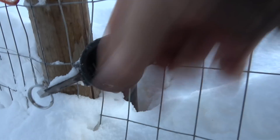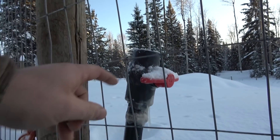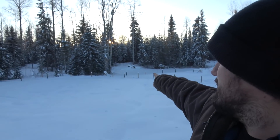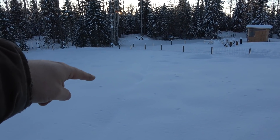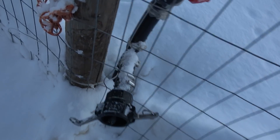And this is the really easy quick connect for the pump. I can prime this guy and it takes about 3 gallons of water to fill the line. However far back it goes, the water elevation in that line is the same as in the pond, so that's like 10-12 feet below this level. The pipe goes down and over, so the water in this line is probably like 50 feet away. It's a one-and-a-quarter inch line and it takes about 3 gallons to fill it up. As long as you do that quickly, you fire this pump up right away. But as soon as you leave it for 5 minutes, it drains back into the safety of the earth. So let's fire it up.